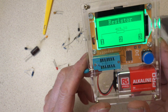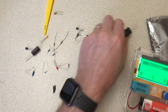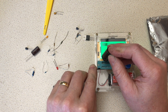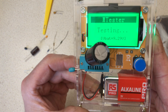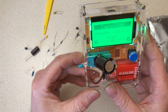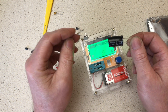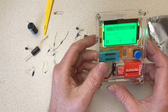469 — so that's a 470 ohm resistor. You could keep testing all night. I've got a bigger capacitor here. The manufacturer claims it'll do triacs, diacs, resistors, capacitors, transistors, SCRs — really quite capable. Let's put another cap in there. You can see it's just taking a few seconds to charge up, and that says 3,278 microfarads. On the can it says 3,300 microfarads, so again very close. It tests ESR as well.